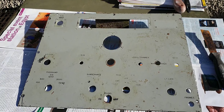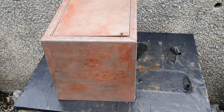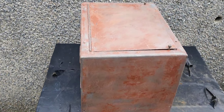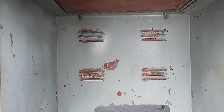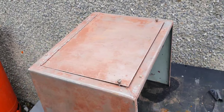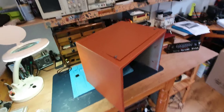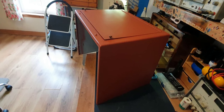Next to the call sign there's more writing - looks like '15.0', probably a frequency or time - very hard to see exactly. I'm going to strip the paint off and everything needs to be rubbed down and repainted. That's the case rubbed down - some of the red oxide came off when I rubbed it. There are a few little speckles so I'm going to give that a wipe over with some white spirit and then give it another coat of red oxide. Two or three coats and it doesn't take long to dry because it was a nice day - I did it outside with no wind.